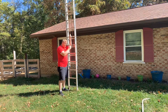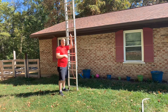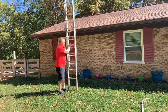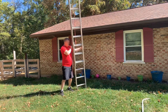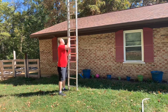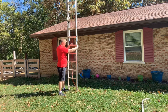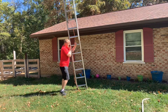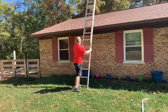If you're on a 40 or 35-foot ladder, you definitely need two people - one person can't do a 40-foot ladder unless you're just a beast. Once we get it to the desired spot, we want to be three rungs above the roof. If we're leaning this ladder, make sure it's flat and goes right up against the house.